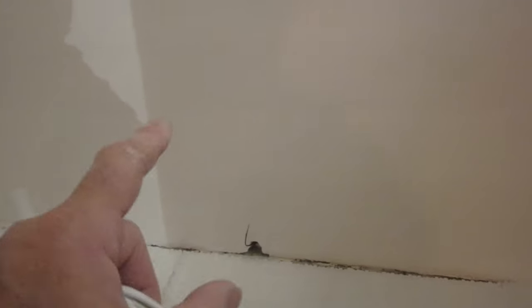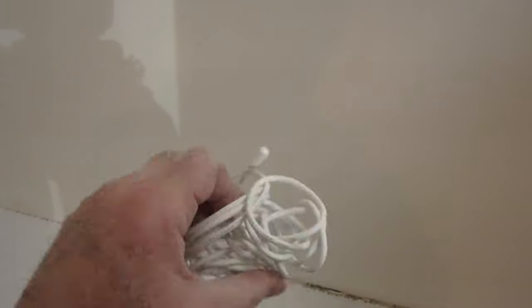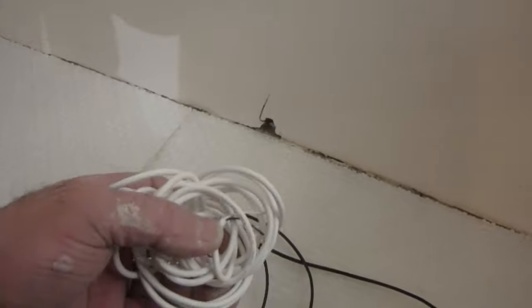If you've got conduits, which would be a pipe, like a tube that goes down from the box to the floor, then you have to have two separate conduits, one for the heat wire and one for the sensor wire. You can't put them in the same conduit because you could have some electrical interference between the two and throw it off. It can happen. So just something to be aware of. Or you can have one conduit for the heat wire, and have the sensor wire going up the cavity wall and into the box.